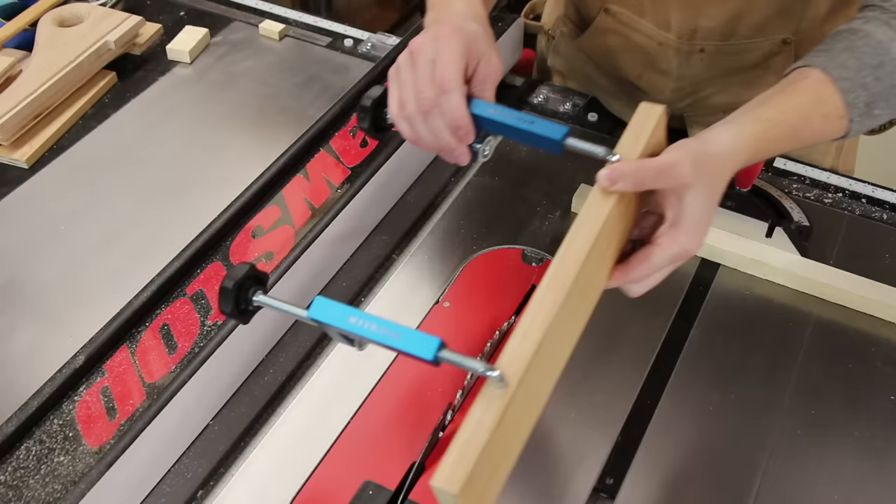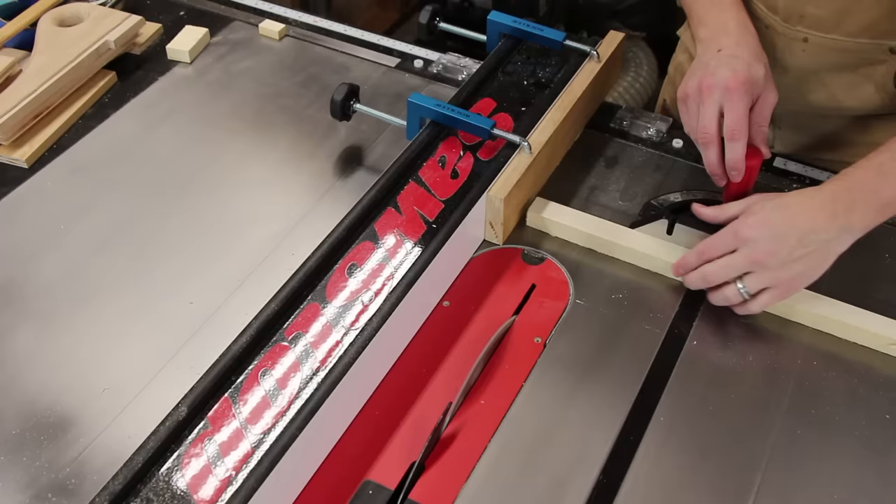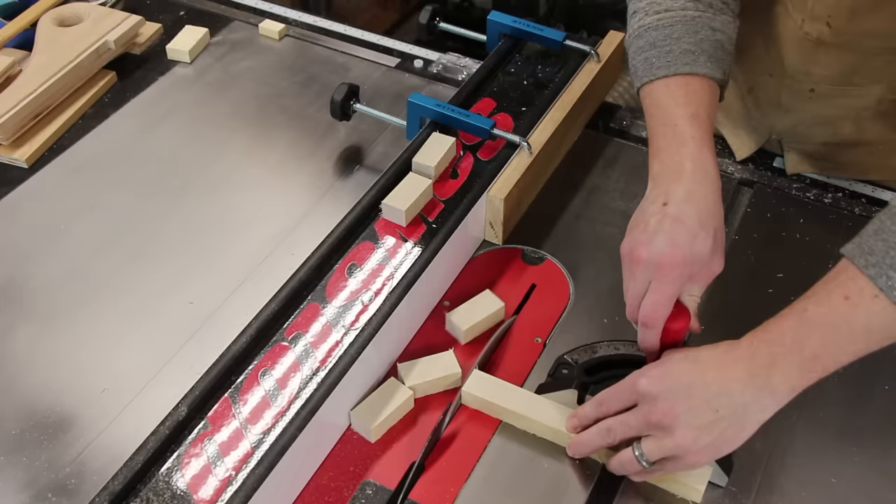This next tip is a table saw tip. Let's say you've survived most of your life without making a cross cut sled — I'm not proud of this, but I plan on making one. So if you're trying to do repeated cuts, say everything at 2 inches and you want to cross cut those, but it's too small to do on a miter saw and you don't want your hand an inch away from the blade, I use things called fence clamps from Rockler. You put them into a board and have a short auxiliary fence in front of your table saw blade. This lets you set your fence to cut whatever length you want, then slide your board over on your miter gauge to that position and cut each piece. Because the fence stops before you actually make the cut, there's no pinching the wood between the blade and the fence — much safer. I've used this so many times I keep my short auxiliary fence stored and ready to go.